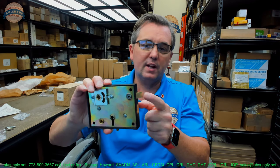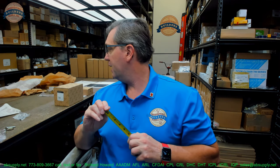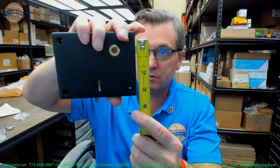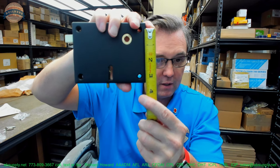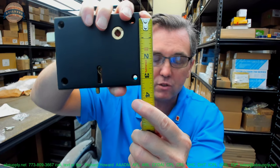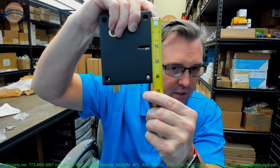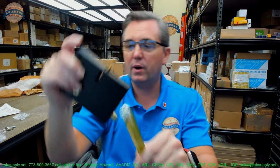This is the latch — that's going to automatically latch. That's the bolt. Now, one other thing: let's look at where the screw holes are, if you might be replacing one. Center to center horizontal: looks like about three and seven-eighths inches. The part number suffix 190 means black — this is the black finish version.